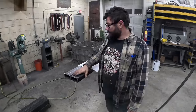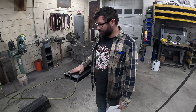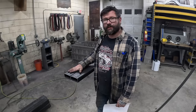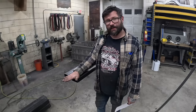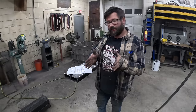Tubes are all cleaned up and now it's ready to lay out. One thing I always make note to do is this side does not have a seam on it and this side does have the seam. So I lay them out together and I always make sure one is seam side down, one is seam side up, and I'll mark it to note that this is the top and the front. That way when I bend it, I always get the seams on the inside of the rail.